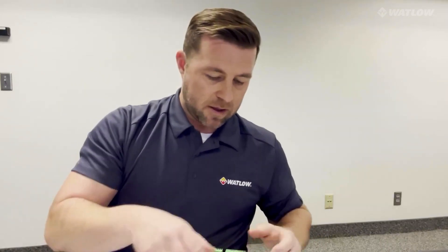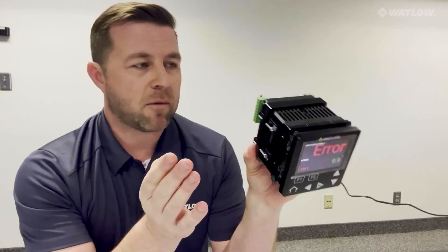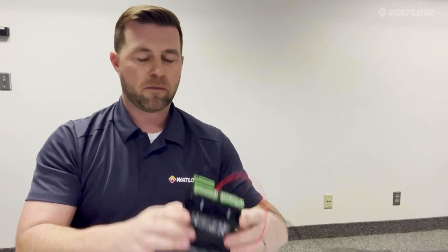Let me take out the connector — I have one that's already wired up. I'll turn the power on. This boots up pretty fast. We have a new splash screen, a little more colorful, and then it will show your Bluetooth configuration and which firmware you have. We have an error message, which I was expecting — we have an open loop right now. Let me throw this RTD in. There it is.